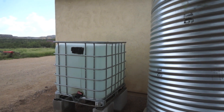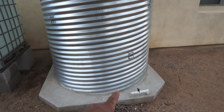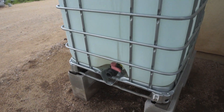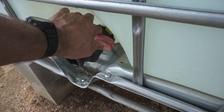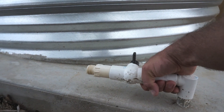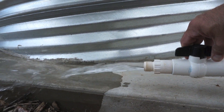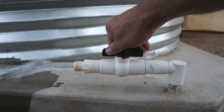At the end of this video I'll show you it actually overflowing and where the overflow eventually goes. And if you're wondering why I have an IBC tote just next to this culvert cistern, it's quite simply just for added capacity. It's raised up on some blocks, and when the cistern gets full I simply transfer from that valve down there with a hose to the top of the IBC tote. For the hose setup, I added a PVC ball valve assembly onto the end of a 90-degree threaded stub-out. If I had to do it over again I might not use PVC, but for my purposes it's working well and I can change it in the future.